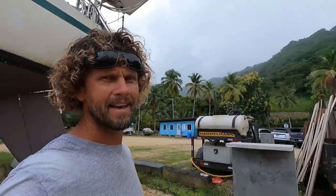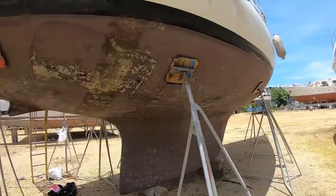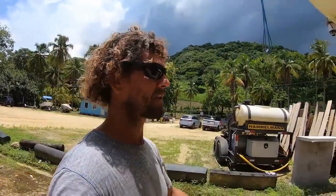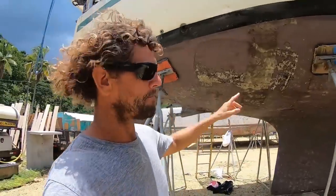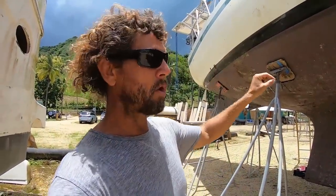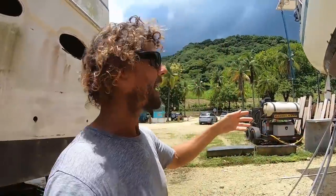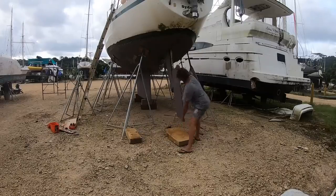Sunny and beautiful one moment — hear that — and here it comes. It's a scorching hot day but we keep losing the sun. The hull's completely dry. This section is hot — it's had sun on it about an hour ago — and this section is less warm, still warm. What I'm hoping is the water in the core is expanding under the heat, and any little splits should start to weep. But as you can see it's completely dry. When I looked at the rudder post it was weeping — there must be a hole or split there — so off comes the rudder.